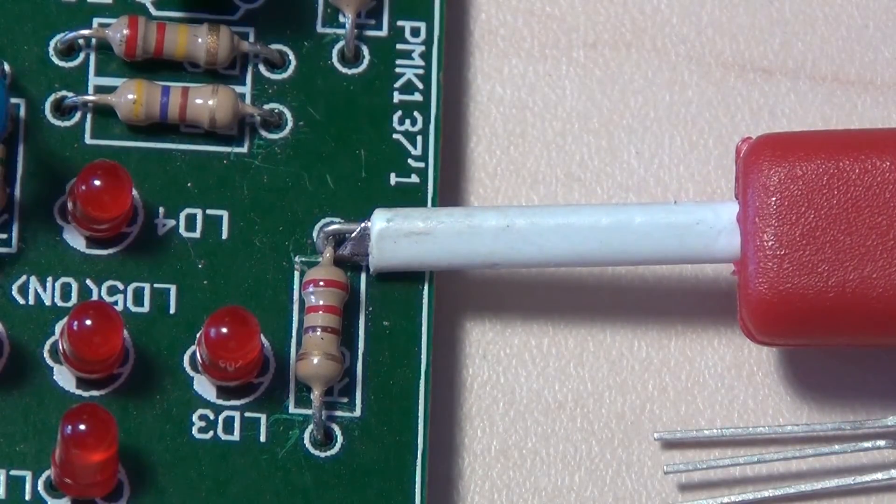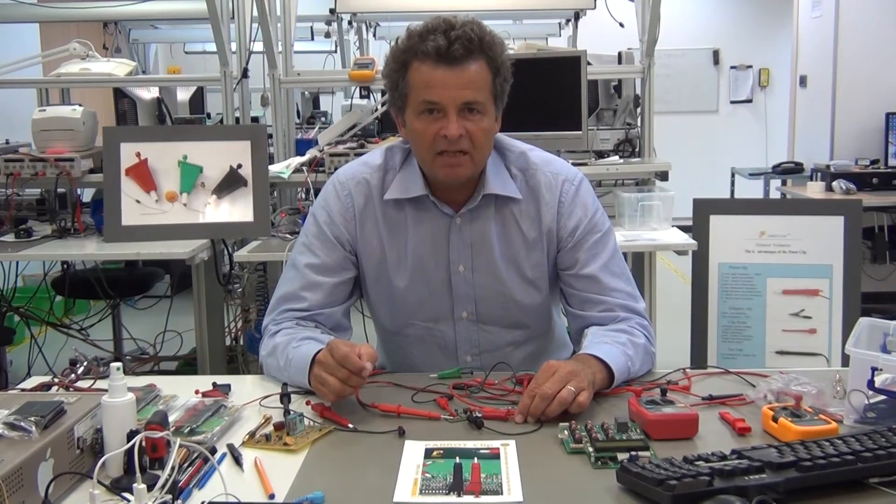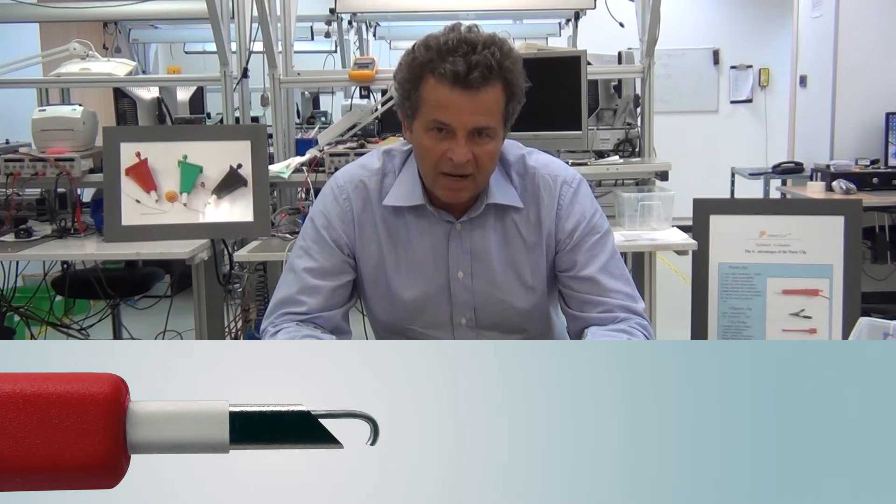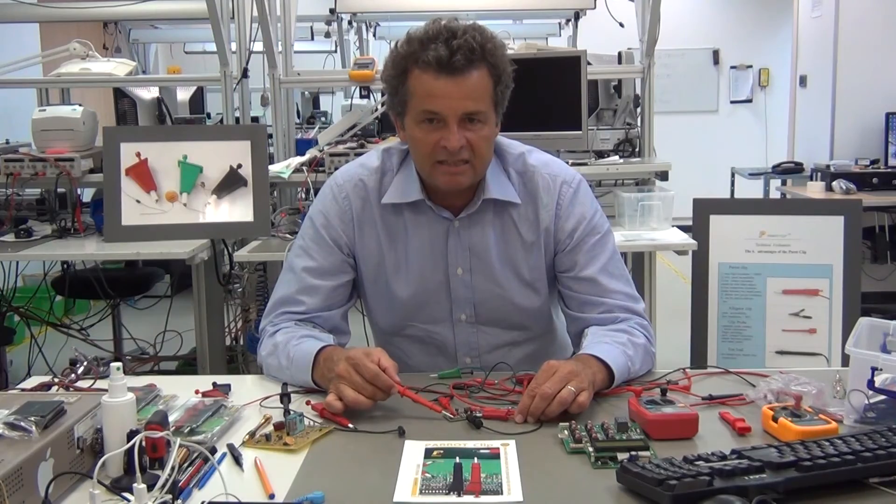For hands-free grip-on measurement, the metal tip and the hook-ended metal rod provide both precision and a very reliable connection. You get low connection resistance as the connection is made between two metal parts, reliable connection even at high temperatures, and again excellent accessibility.